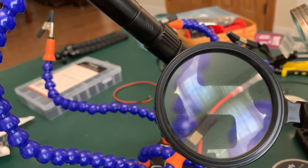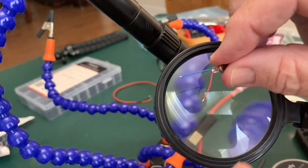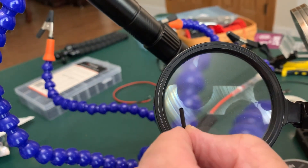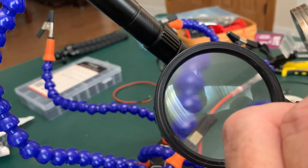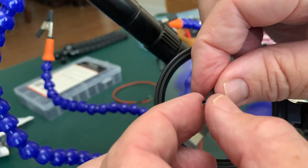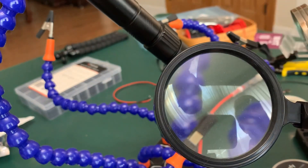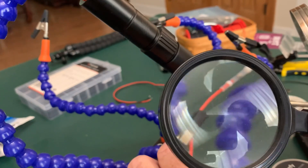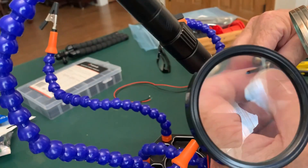What I've done is this: I've taken the motor and added a tiny piece of heat shrink — I believe it's 1/16th of an inch — cut so that it just slides over and leaves the conductor exposed at the end. What this does is make that little 30-gauge wire thick enough that the connector can grab it, ensuring we've got enough mechanical support so it won't pull out.